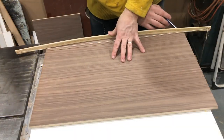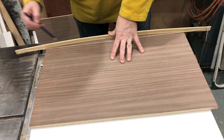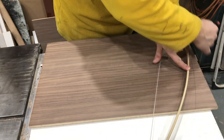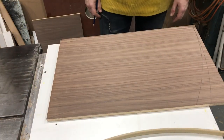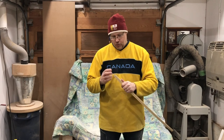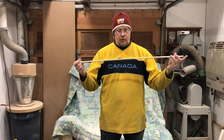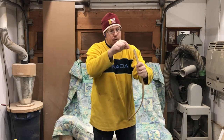The base of the cutting board or charcuterie board is a piece of half-inch particle board with a walnut veneer. I'm just applying a variety of curves to get the look that I want — I took some images from online and I'm just trying to mimic that look. To get the curves, I'm using a piece of trim with some string attached on either side. If you loosen or tighten that piece of string, it goes from straight to whatever radius you want — it's very easy to use. You just put it on your leg and tighten it up.